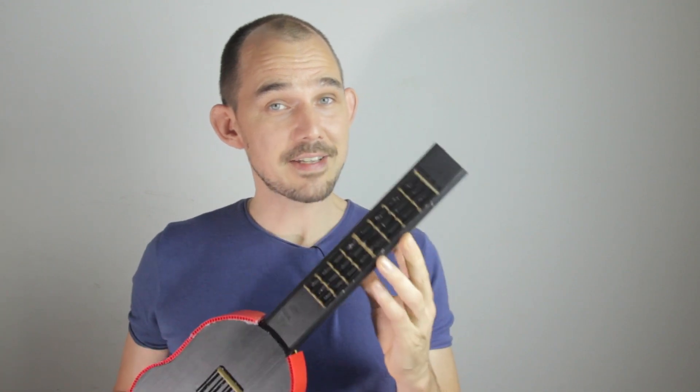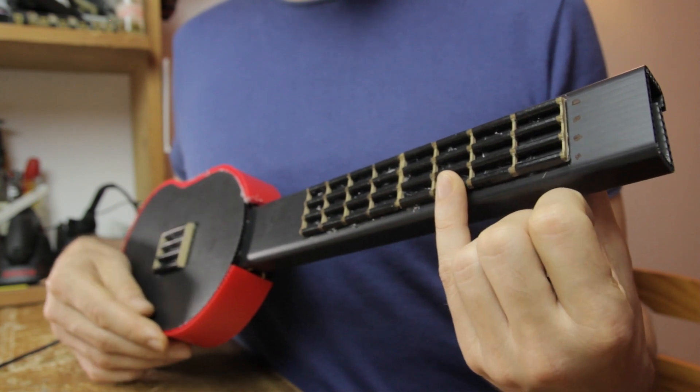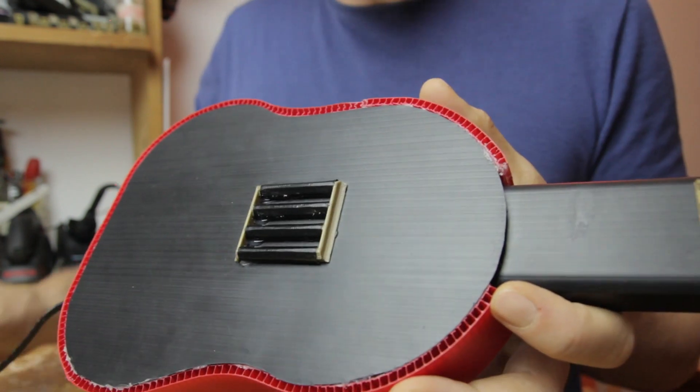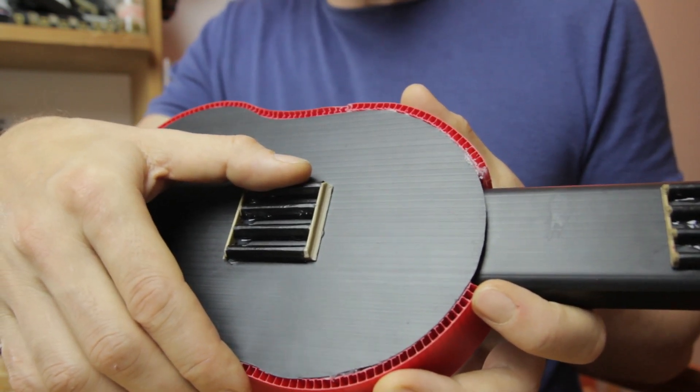Let's talk about the sensors and how they actually work. These are capacitive sensors, just like on the Continuum Lab wind instruments and keyboards. So they don't measure string tension or anything like that — they don't vibrate or move at all, they just measure touch. Put your finger on one and it activates with a higher reading if you touch it with more finger surface area. That works really well for the sensors on the fretboard, because I just need to know if a finger is on there or not. But the right-hand string sensors have a different and quite specific functionality: when you touch one, nothing happens, but then when you release it, it produces an output.